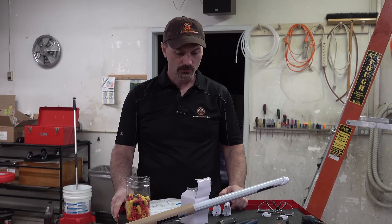I've removed one bulb and I've just got one more to take out. There's going to be a metal cover — depending on your fixture it could just be something that needs to be squeezed. This is just a wide open fixture, but if yours was more fancy you might have a cover that you squeeze and clip out. In our case this cover comes off with a couple screws. I've already loosened one end, and now we've got all the bulbs and the cover out of the way.